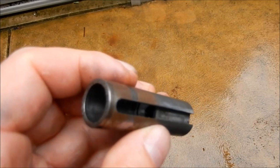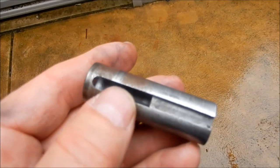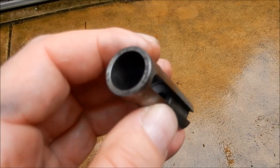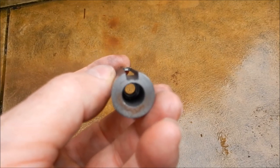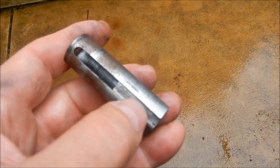All right, guys, that's the adapter shaft out. You can see that external key that I've had to put in that drops through into the keyway of the shaft, and we hold it on with a little cable tie. But it's just a blind hole in there, so that it butts up against the end of the shaft, and we've got a socket cap screw down the other way that locks it onto the shaft, and we've got the key here that drives the pulley.